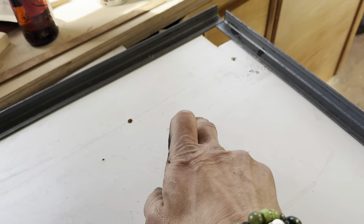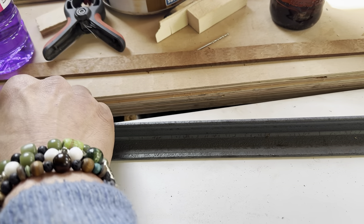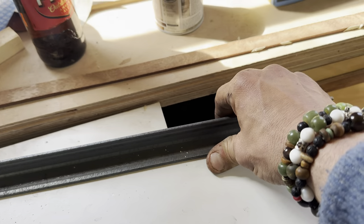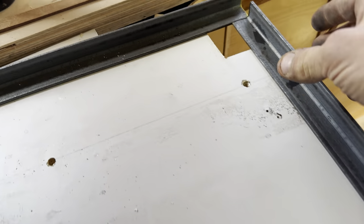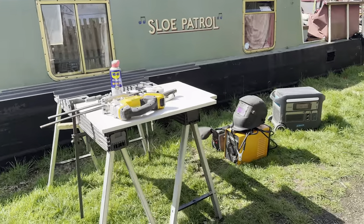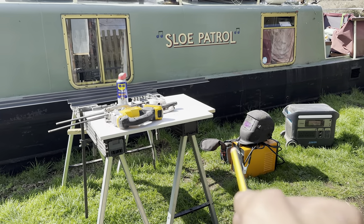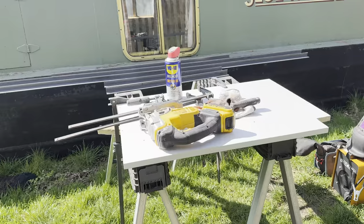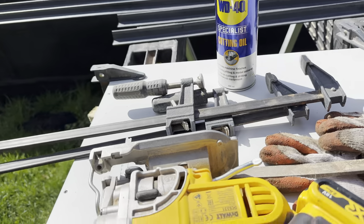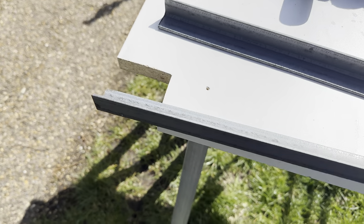The jig I'm going to use is a bit of the old kitchen off cuts. If I mitre those two off and clamp them, line them up so I've got it on the right angle, clamp them so they're not going to budge anywhere - that gives me the area to weld in. I've got all the bits I need: power, the welder and welding rods, angle grinder, jigsaw, a load of clamps and cutting oil. Annoyingly, sweary Dan has gone out for the day. He said he'll be back later, but I need to make tracks on this now.